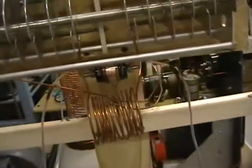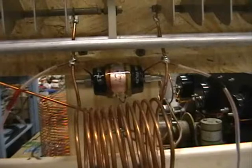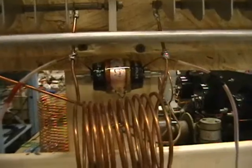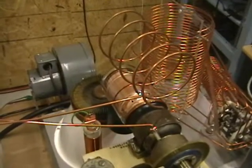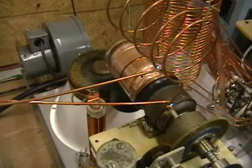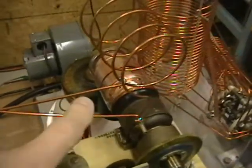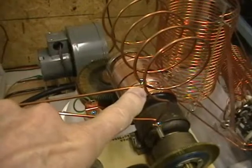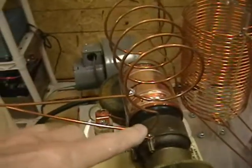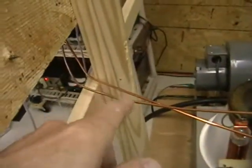Because the main capacitor does not have adequate capacitance, a small fixed vacuum capacitor, shown here, is installed in parallel with the main coil and the capacitor. In this view, we're looking at the tank tuning capacitor, which is connected between the output of the tube and ground, tuned by the large adjustable vacuum capacitor shown directly beneath the coil. A wire connected to a tap on the coil takes RF energy from the coil and brings it over to the secondary tuning coil. The return RF path comes back through another wire to the ground connection on the coil. These two wires form a parallel RF transmission line, resulting in minimal RF radiation from the amplifier.